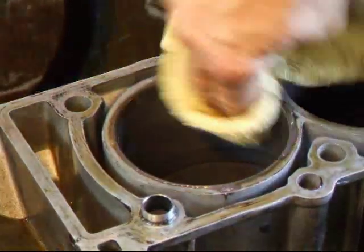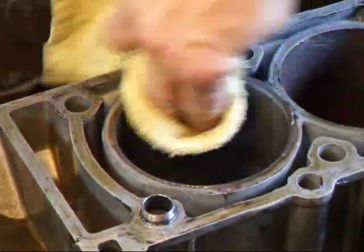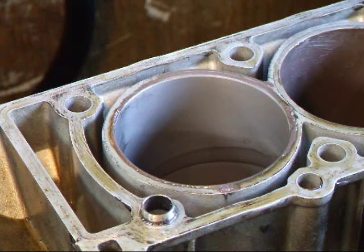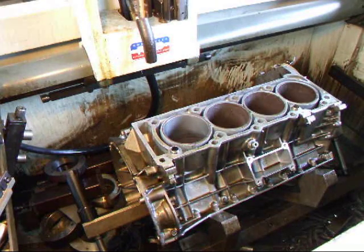I'm going to wipe this down, and what you're not going to see is a crosshatch pattern in here, because we're actually lapping the cylinders — it doesn't leave a crosshatch pattern as would be typical with a normal honing job. This is how we do these Alusil blocks. If you have questions about Mercedes machine work or Alusil block problems, give me a call here at Costa Mesa R&D. We'll see you soon.